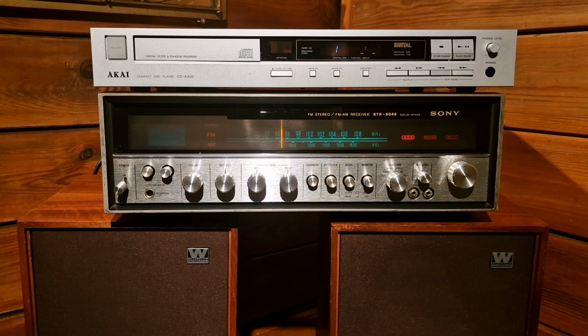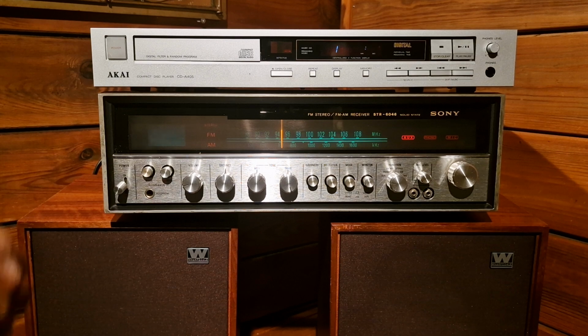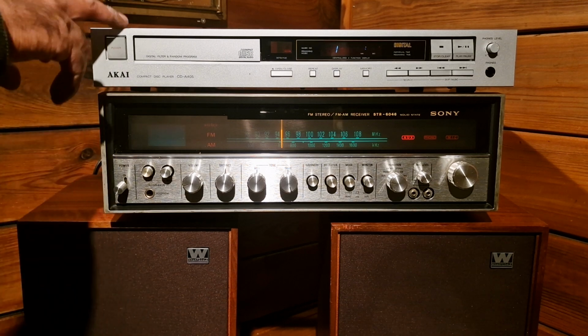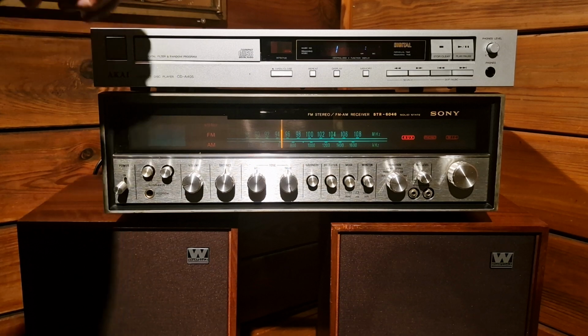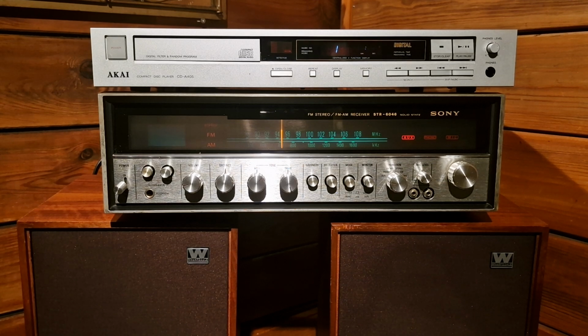So this has a digital converter PCM 565PG, which is made by Sony. It's not the Philips TDA, so don't expect a very high quality Philips-like sound from this CD player, but of course it has less distortion like all CD players, but it's not as sharp and warm as the TDA chips, and of course it has only analog output. So this came basically with the remote control also, around 4 kilo, very good build quality. Mechanism is very good. It is the MLP 9E. Sony also uses the same mechanism, the tray loading system, which is quite sturdy. That's what I like, and the display. But the chip is not high end. It's a regular chip, but it produces a good sound.